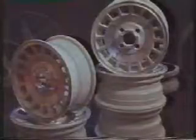Low-pressure die casting is an ideal method for this kind of component. Each of these machines can produce up to 85 wheels a day, and the whole production unit can turn out around 4,000 castings a week. If you could shorten the time the metal takes to cool in the die, you could significantly increase your output, and this can be done.